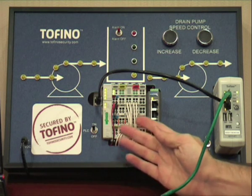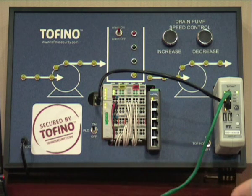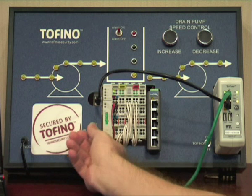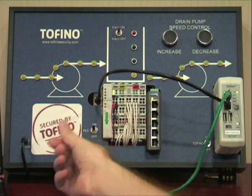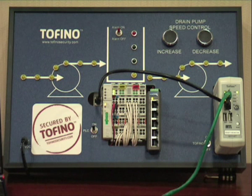In the last stage the PLC is crashed. We can see no LEDs are operating anymore. The tank level is not indicated anymore, and only a complete power cycle will bring the PLC into a regular condition. The PLC is now booting up its firmware and after a short while will resume regular operation, indicating inflow, outflow and filling up the tank up to the set point.